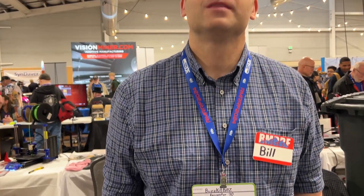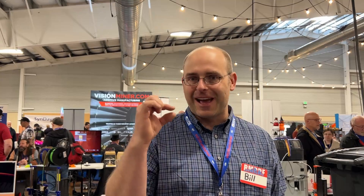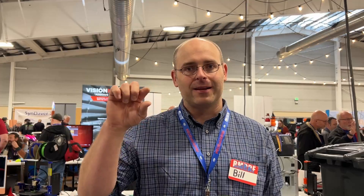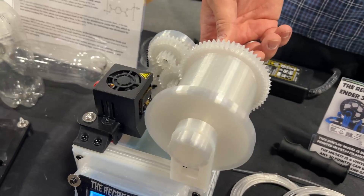Just a little thing about the nozzle — the filament diameter is 1.75. So if you are going to do this, the hot end needs to be adapted to 1.75. In my experience, I found I like to make mine a little bit smaller. Josh has all the instructions on how to do it because you take a drill bit and drill out the nozzle to the right diameter. I like to pull my filament a little bit smaller because sometimes I get inconsistencies in diameter. When I first did my first pulls, I had a nozzle that was exactly 1.75, and unfortunately my filament was bubbling or swelling a little bit and jammed up my nozzle. So what I do is pull it a little bit smaller — about 1.65 millimeters.